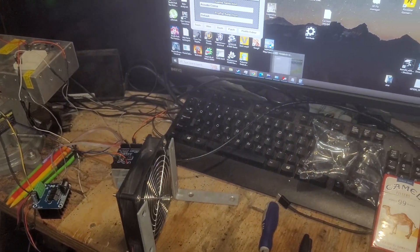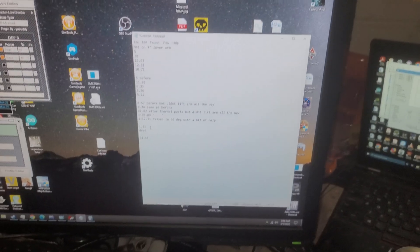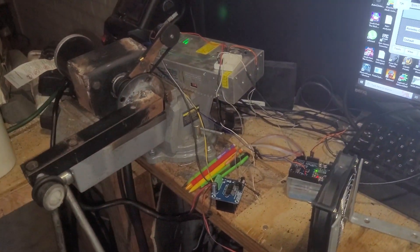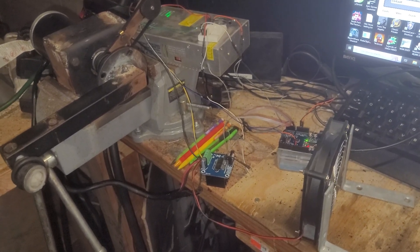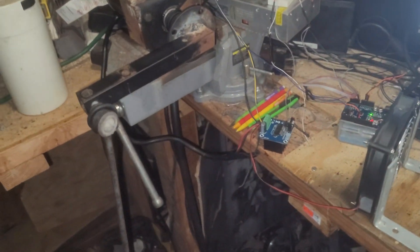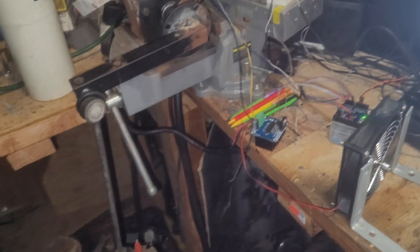Essentially I just record the seconds each unit can hold for 40 pounds at a seven-inch lever arm on this motor — that's how I test and confirm the IBT2s are good on 24 volts under load. My last video was showing how to test the IBT2s on 12 volts to make sure they can operate in both directions. This is the next step: confirming they actually work at the voltage you want to run them at with an actual load. It doesn't necessarily have to be 40 pounds on a seven-inch lever arm — just whatever load is relevant to your application.